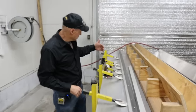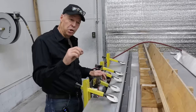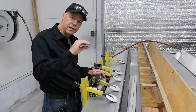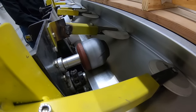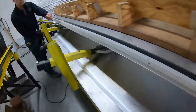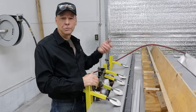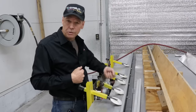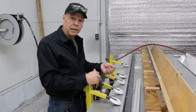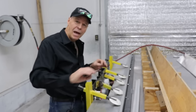This roller has two striking points and it only strikes the A side. What it does is put what's referred to as the reflex on the blade. If you look at the blade, you'll see the trailing edge is slightly bent on one side. That reflex is very critical — it's a direct result of where the center of pressure of the blade is when flying. In a helicopter, it's a direct result of how much collective pressure there is when you pull up. If the center of pressure is too far back, the pressure to lift gets extremely heavy; if too far forward, it can create negative pressure. That's why it's so important to strike a perfect balance on that reflex.